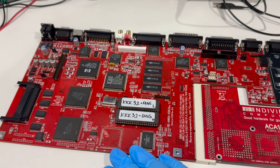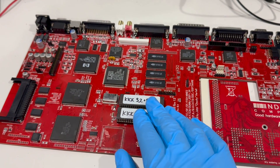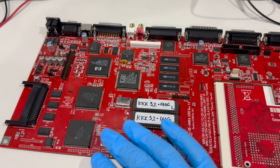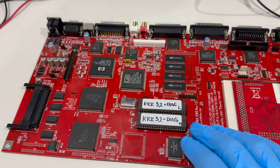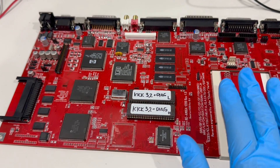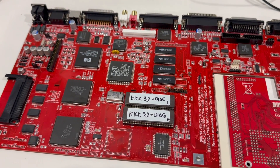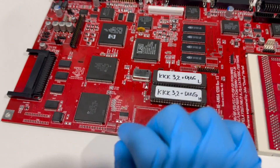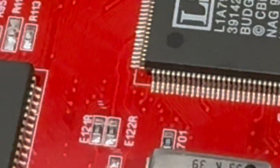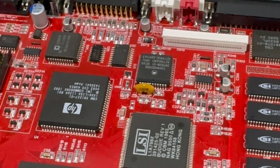What is interesting is that usually when I do something like this it takes me about three days and there are five or six things not working or not soldered well. But if you do it with an industrial stencil printer and pick-and-place machine, the first boot was perfect and every single component was soldered beautifully. I mean I don't know if this can do it justice, but if you can see, this is really industrial-level perfection. It's just beauty.